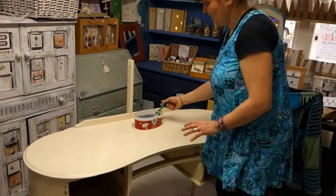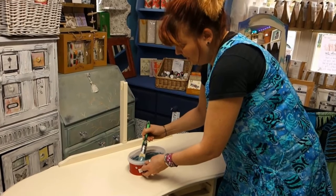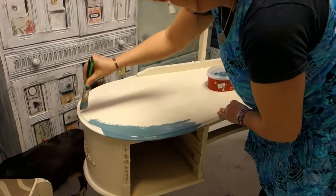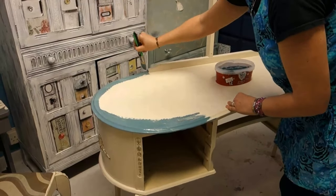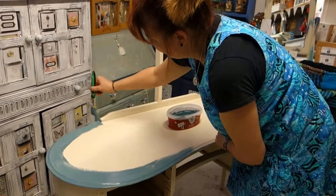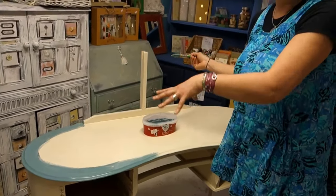So I want to see how this milk paint works. I wanted to create a layered chippy paint effect — I don't know if that's going to work but we'll give it a go. This blue is going on underneath and then the white's going to go on top. I might not paint the whole thing in blue, just significant areas where I'm expecting it to be distressed back and show. It's going to need a second coat because it's a gorgeous colour, isn't it. Once we've got the blue everywhere and a second coat on, we'll show you what we're going to do next.